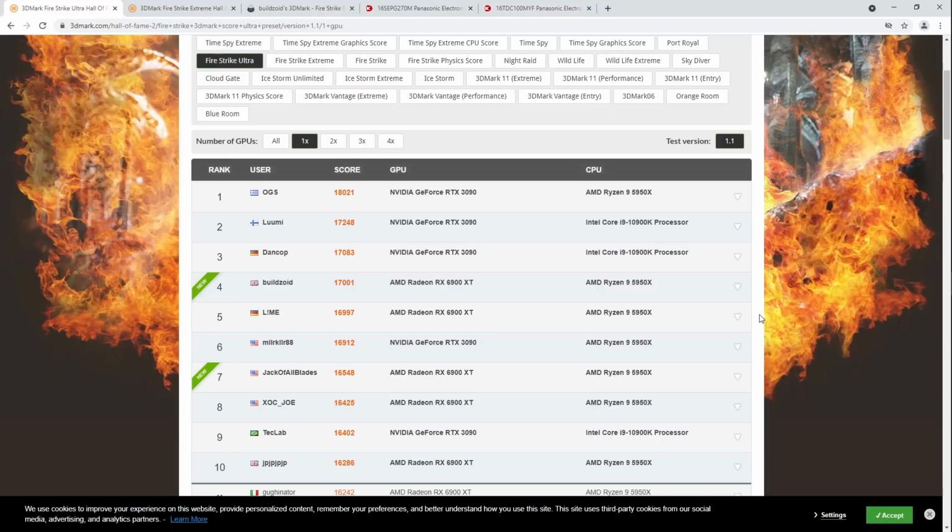Anyway, I bought it and I plan to spend more money on getting it into a better condition than it comes in from the factory, which is why it's already in a better condition than it comes in from the factory. From an overclocking perspective, not necessarily a reliability perspective. I've not yet had a capacitor fail on me due to how I've soldered it, but from reading capacitor documentation, my soldering technique is definitely not what would be considered safe for long-term use. So from a reliability perspective, I think we can say this is probably worse. But from an overclocking perspective, it's clocking better than when I first got it, even at the exact same voltage.